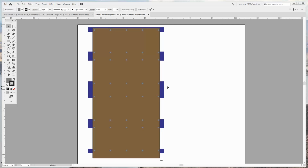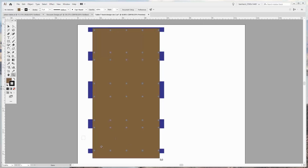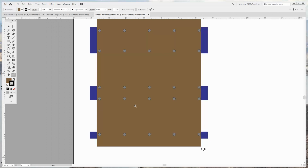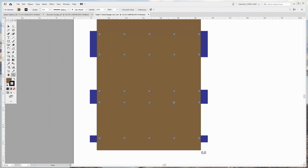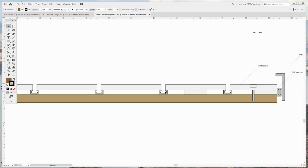So when I first set up the machine, you have to actually manually put in the inductive limit switches, setting where the front and back of the machine is. So it's basically kind of up to you. And I remember actually that took me a while to dial in. So in this case, I had to draw in very accurately the errors in it. So see how these bolts are also not centered on the plywood. So yes, I had to make sure I had this correct because I don't want to accidentally drill into these bolts. I want to put in some T-track, which allows you to slot in nice clamps.